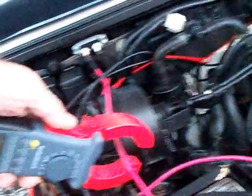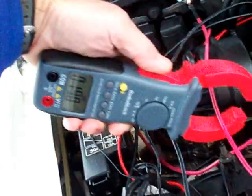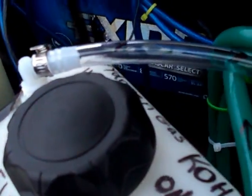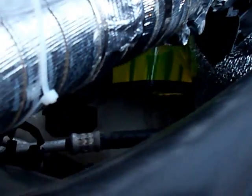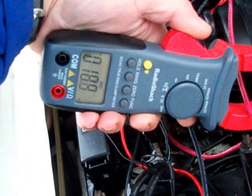Here's some bubbles — you can see the gas production right there. Nothing coming out of the bubbler this way, so that's good. I didn't expect it would at this temperature. You can see gas flow. We're at 33 degrees. According to the display we're at 17.5 to 17.6 amps, and checking our amperage on the clamp meter again it's showing 18.8 amps.